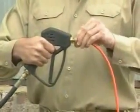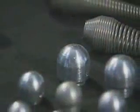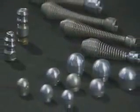When using a gas jet to clear inside lines, couple the 1/8-inch hose to the end of the 3/8-inch hose using the trigger from the spray wand or the foot pedal. With the use of specialized nozzles, your jetter can be equipped for almost any situation. Use the penetrating nozzle for maximum power to cut through grease and ice. Use the wide spray flushing nozzle to clean and pressure wash the pipe walls thoroughly. For tight bends and P-traps, use the spring leader nozzle. The down-head nozzle takes the hose down T's and around difficult bends. The rotary nozzle scours the walls of the pipe for real wall-to-wall cleaning action. It's best to start with the penetrating nozzle to break through the stoppage, then follow up with the wide spray nozzle for a thorough cleaning job.